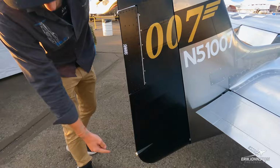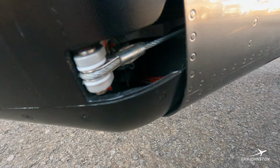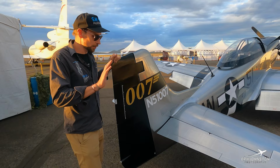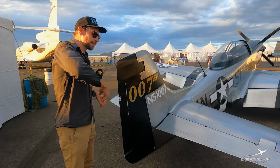We also have a tail light, a white tail light here. Here, as said, you can see the rudder cable. The rudder is the only one which is connected with cables. This is also, by the way, the reason for the 260 knots limitation we currently have, because of the rudder. In terms of flutter speed, it's always the loose control surface. So it's not like you stand on the rudder, you keep it fixed. No, you have to assume a loose rudder, because maybe you are making breakfast or so, and then you get hit by a severe gust and then it starts shaking.